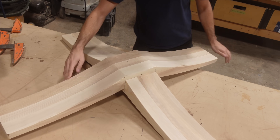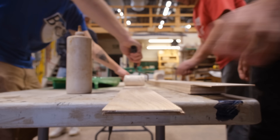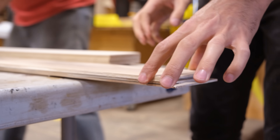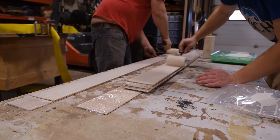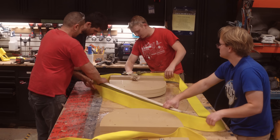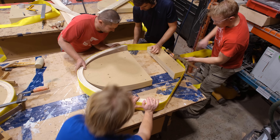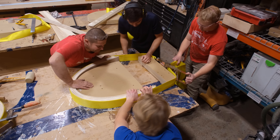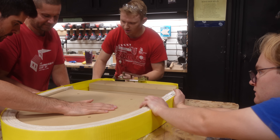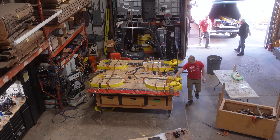As an adhesive we're using Titebond 3, which is probably overkill since it's designed for exterior environments — but with most of our pieces the design is overkill because we want lots of longevity. For the bent laminations we had to do four of them, creating jigs from MDF and getting creative on how to clamp around such a tight radius. What we came up with was very large ratchet straps, which did an excellent job of pulling all those plies tight to the form. We also leave these laminations in the clamp much longer than a typical tabletop glue-up, because if you don't give it that extra time you get quite a bit of spring back. In this case the laminations stayed in for a couple of weeks, and then we can pop them out and begin scraping off the excess glue.